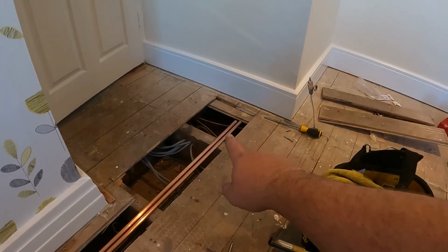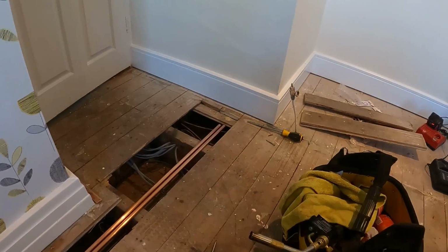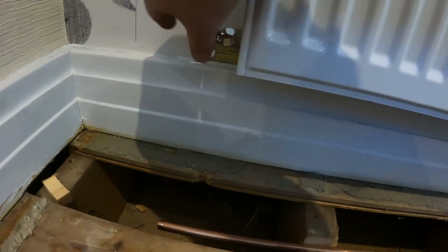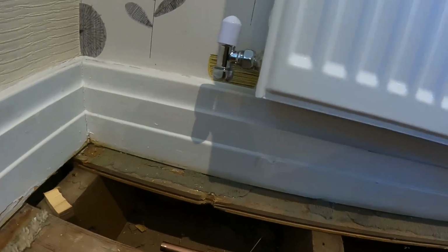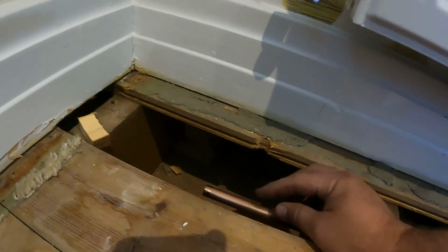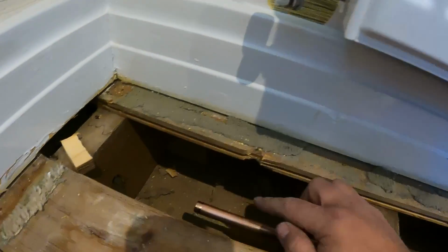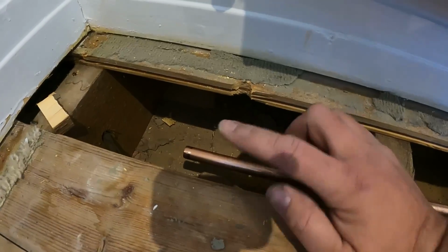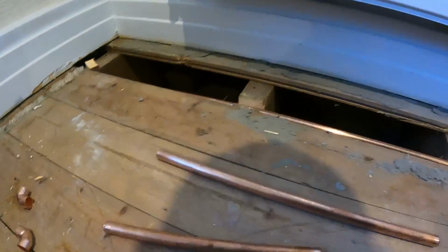And as I said, we'll just drop the pressure out of the system, and we should be able to get onto them pipes fairly straightforward. He says, touch wood. Right, we're ready now to get this pipe work in. All I'm going to do here is bring down a length of pipe down there, like so, with an elbow on, and then all we've got to do is put it into position, mark up this bit here, mark this pipe along here, cut it, and that'll be that one in. So, it's as straightforward as that.